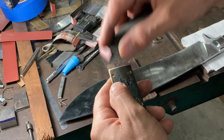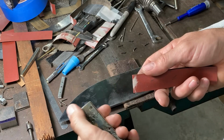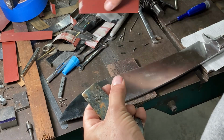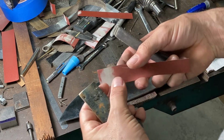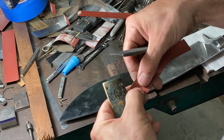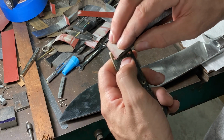I had taken the scale down on both sides in thickness to the height that I wanted, but then I'm just carefully blending the front of it, again with that baler belt backer, first with 400 just to get the shape, and then with 1000 to just polish the front of that a little bit, and I go hit it up on the buffer again.